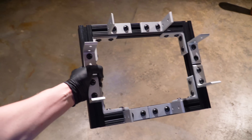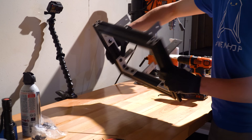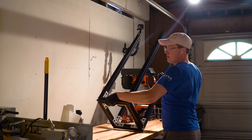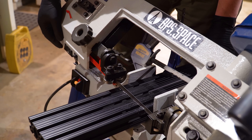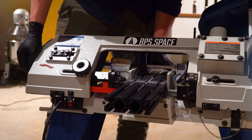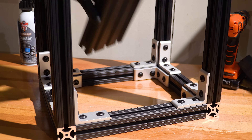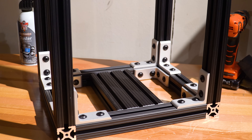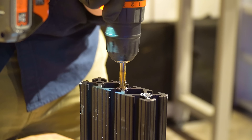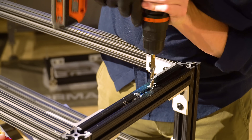The base is held together in a slightly rectangular setup with one-foot segments, and I made a mirror image section for the top of the stand. Between them are four-foot-long extrusions at each corner, and once the whole stand is put together it's quite rigid. On one side of the four-foot segments I used a horizontal bandsaw to chop up and mount a section of triple-slot extrusion for mounting electronics later. For the central base I used the rest of that triple-slot extrusion, found a bolt size slightly larger than the internal holes, tapped those, drilled equivalent holes through the side of the base, and anchored it in using six large hex bolts.